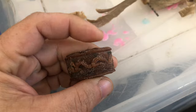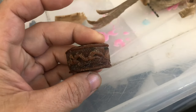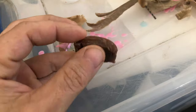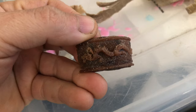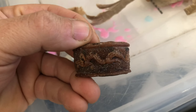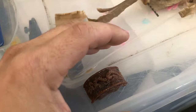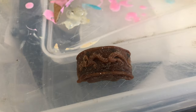I'm doing my own style that I want to put in my rental. The reason why I did half is because I'm just going to do one side, then flip it around and do the other, and then put the waxes together. I started out actually carving it in wax — or sculpting it, really. This is sticky wax and I put a textured background. I'm probably going to edit the background, but the reason why I need to make a mold of it is because I don't want to do that twice. I do want that dragon repeated on both sides, so I did one side.